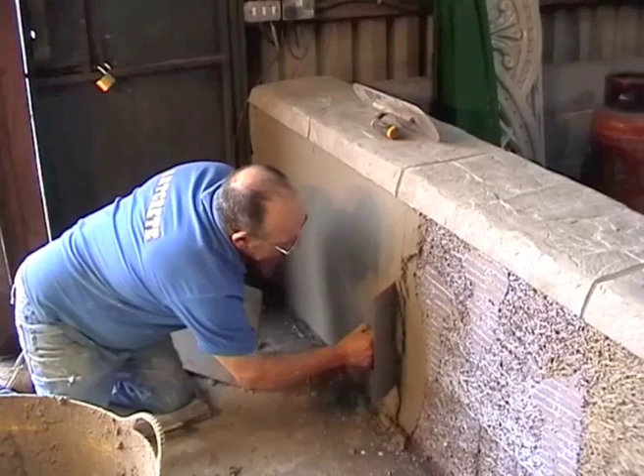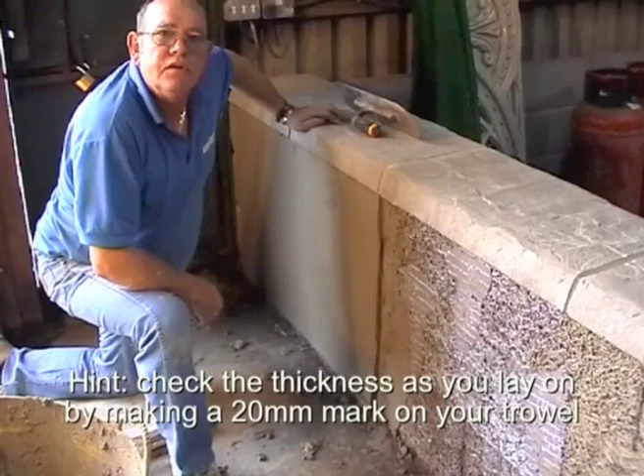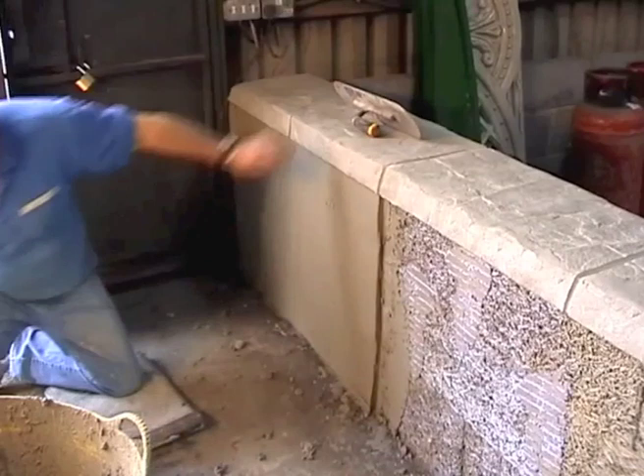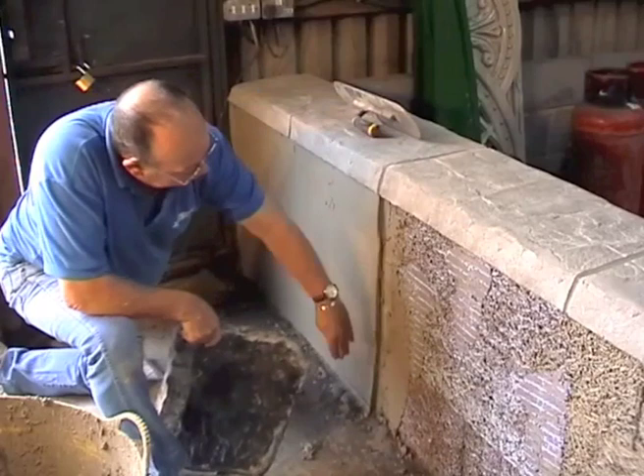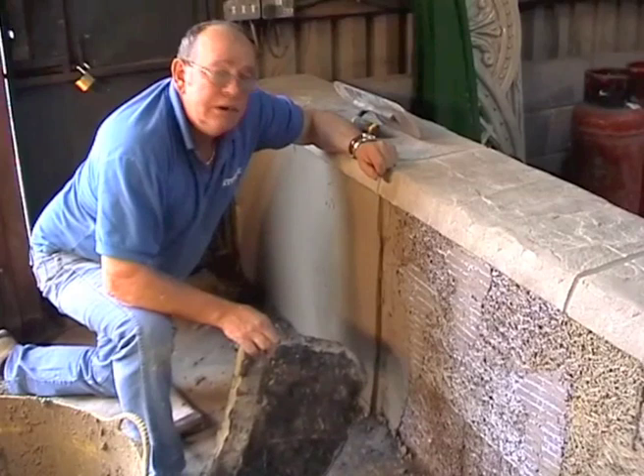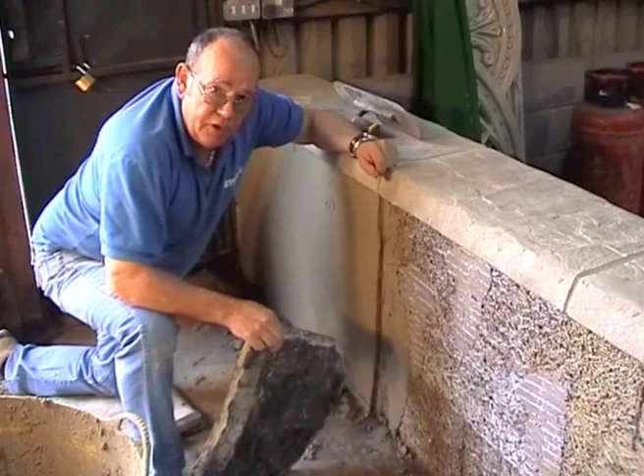As you can see now, we've laid about 20mm over the thickness of this wall because the stamp we're going to use is a 20mm stamp. The next thing we're going to do now is put a texture to it just by using a single mat. This is really useful because if you're not that precise at plastering and you can't get that 20mm evenly all over the wall, this is going to create a stone texture onto the wall for us — it takes literally minutes and it's got a really superb effect.